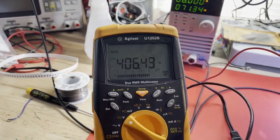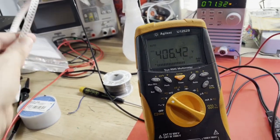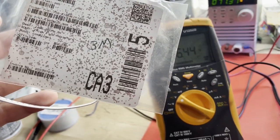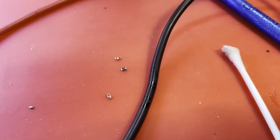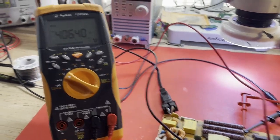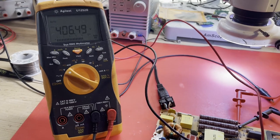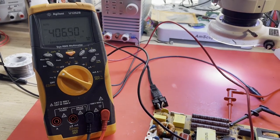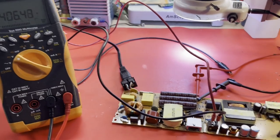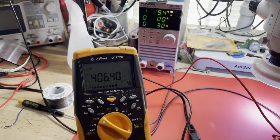Quite likely I need to get some 2-megohm resistors — they need to be reasonably tight tolerance because that's what determines that PFC output voltage. I think she's working — she's hanging in there, making 12 volts at 6 amps. I might be able to sort through these 3-megohm resistors and find some better ones. These are 5% tolerance. These capacitors are rated at 450 volts so I don't think it's a problem really. I think we're ready to put this thing back together and try it out there in that PS4 Slim chassis — it's been patiently waiting out there. Let's see if it'll power that thing.